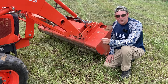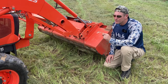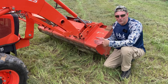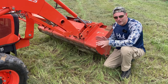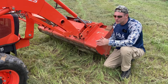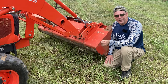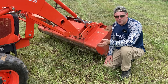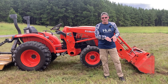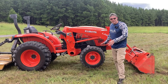A lot of people say you're abusing your tractor if you lift the front tires off the ground — that's not true. These tractors are very tough and they're built to do that; they wouldn't give you that much hydraulic power if lifting the front tires was a bad thing. Just do a risk assessment and don't do it to the extreme or for 14 hours a day. Also, the tilt and curl function of the bucket on this L series can lift the front tires — a quick way to address a flat tire out in the field if you don't have a jack with you, and it's perfectly safe to do.